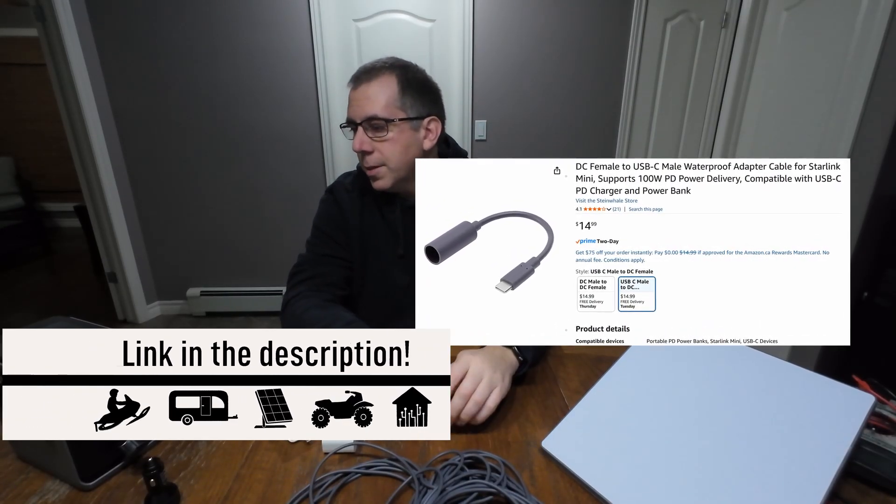Let's do a recap. Your Starlink Mini requires between 12 and 48 volts to operate. What that translates to on the USB-C side is 100 watt capable power sources and power adapters. 100 watt capable adapters and power sources will produce 20 volts. Why do you need 20 volts instead of the 12 volt minimum? Because you do get voltage drop across the line, so you need to be above that 12 volts. Why are people having problems? Because their equipment is only running at 12 volts to start with. If you have a 12 volt power source or adapters only rated for lower power ratings, you're going to run into problems over 50 feet — voltage drop is going to kick in and your unit's going to reboot. It's just a matter of buying the right adapters. Get the right adapter — link is going to be in the description. Get a power source capable of at least 100 watt power delivery for USB-C.